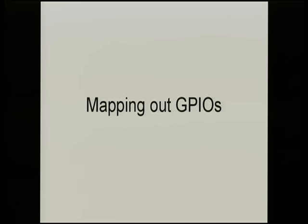My plan was to set the input register. There's a single 32-bit register for 32-bit IO pins. Set them all to an input. Hack the kernel so it doesn't mess around with them while I'm looking. And then keep reading the input register over and over while I poke about on the board just to try to beep them out. I use this amazing piece of technology here.